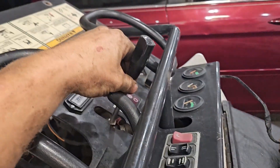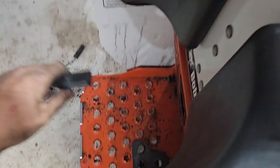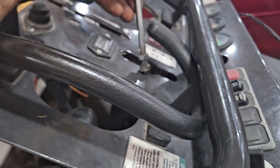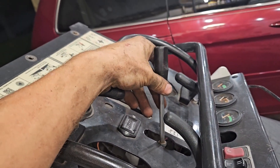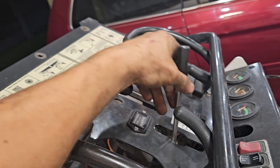There's a test where you push this forward and then you push that foot pedal down there, and then you make sure that it holds the lever in the forward or backward position. Then assuming that works, you take your foot off the pedal and at a count of three, this should return.